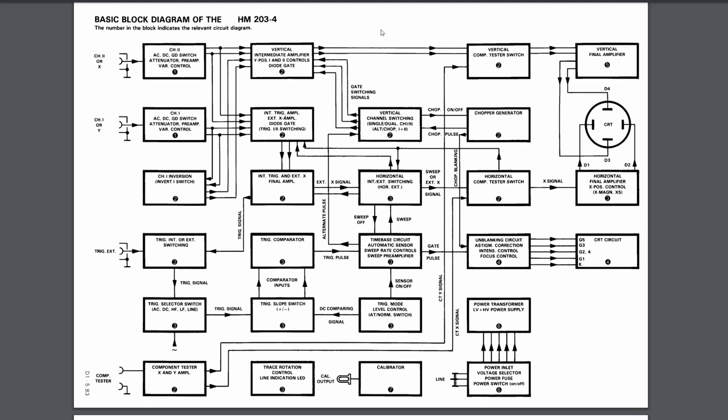Having figured out that the system voltages are likely fine, we now need to narrow down the fault to other parts of the circuit board. If you didn't have the schematic you could try to figure out which input connector has the signal from the preamp, but because we have a schematic and even a block diagram, we'll look at that first. Previously when testing voltages we were looking at the power inlet and transformer section going to block six — the low and high voltage power supply — and as we've seen, this is likely fine. Now we need to find the component tester in the block diagram.